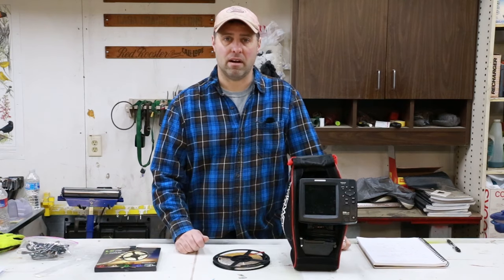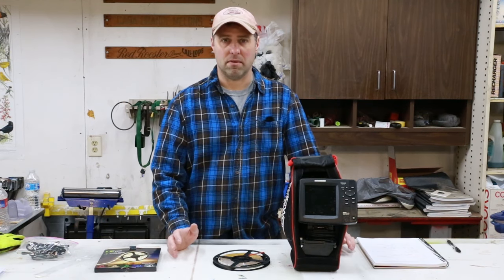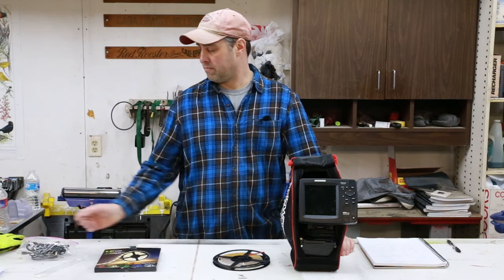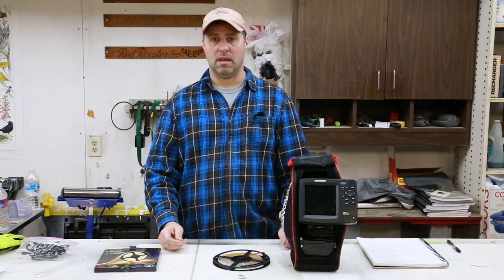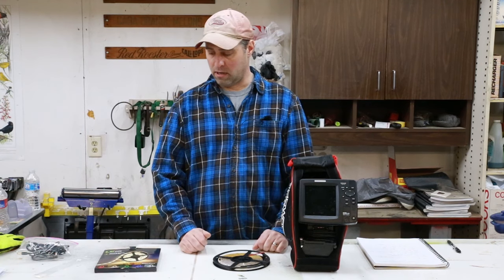We have a 12-volt battery already in our fish finder. Since about 90% of the time we're not really using the lights — it's only those hours or so after dark that we're going to use them — what I did is I found a couple of power adapters, like from an old laptop or something. I found two of them, just took the ends off them, and spliced the two together, and I made a power cord to go between my lights and the fish finder.